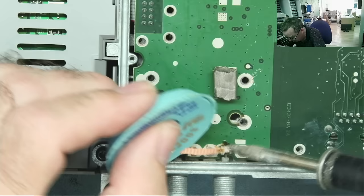There's a CMOS battery, but I'm guessing that is okay because it doesn't seem to lose its settings when it's powered down. The channel settings. Well, actually, that means, unless it's this, this could be the ground end. This is positive. No, it only reads 1.1 volts. It may be that the settings are in some non-volatile memory somewhere on here that doesn't need a battery backup. It could be that's the case, but that is a bit low. Could be a 1.2 volt battery, I guess. I'm not sure what it actually is. 1.12.